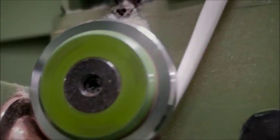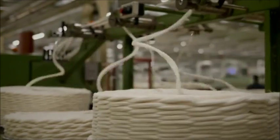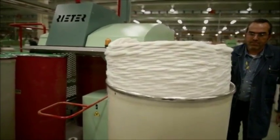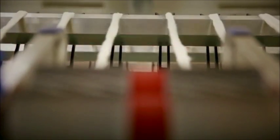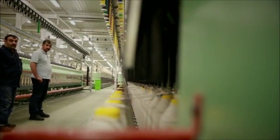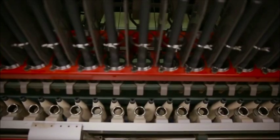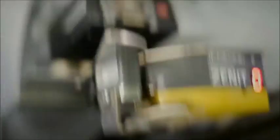Combing machines create cotton sliver before additional cleaning to remove the neps content, as well as the remaining dirt and dust. In the drawing frame process, the slivers from different combing machines are joined to form a homogeneous mix and eliminate irregularities. After the drawing process, we enter an interim step at the roving machine, where we thin out the strip so it can be fed into the spinning machine. Eventually, this raw material reaches the ring spinning machine, which is the final stage of spinning. The production of yarn is complete once the machine completes the twist and draw, and the final stage is forming yarn into bobbins for practicality of use and subsequent processes.